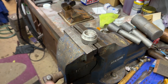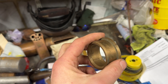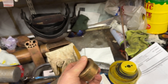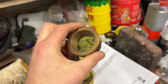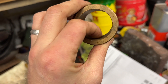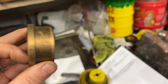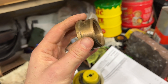I had another look through my jaws and found this bush. At some point it was something — it's actually got a taper on it. You probably can't see, but when you look this way you can't see the bore at all, and when you look this way you can, so it's tapered — small end this end. It's smaller than the bore wants to be, so what I'm going to do is turn it until I get to the bore diameter, and this end is actually bigger than the bore, so it should engage with the rings open.